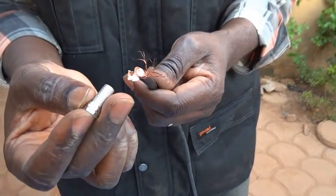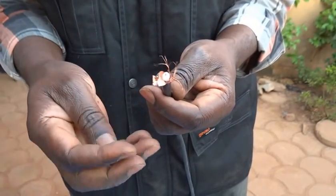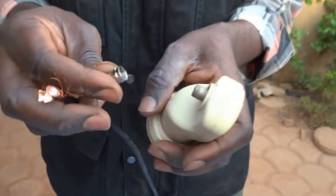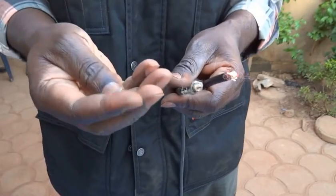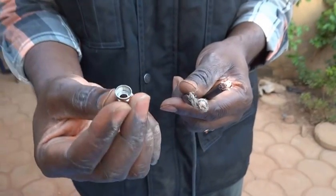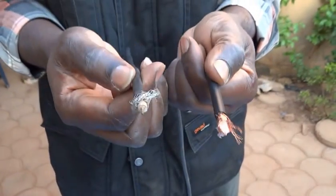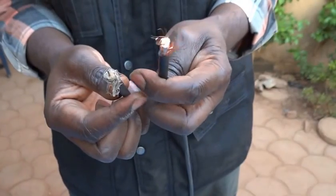We must learn to properly prepare the coaxial cable so that it can receive the F connector, making the connection between the wire and your LNB. Before showing how to connect the F connector to the extremity of the coaxial cable, it's also good to know that there are different types of coaxial cable on the market — some are good quality.